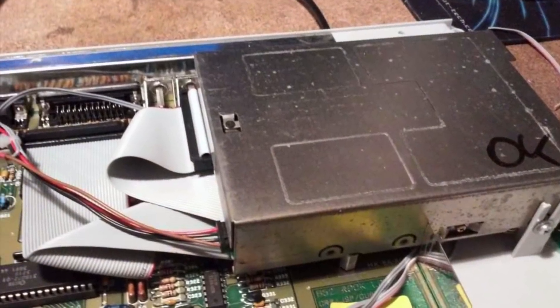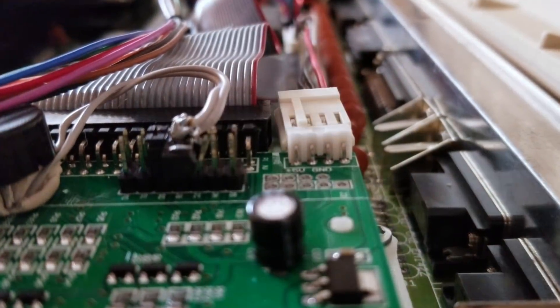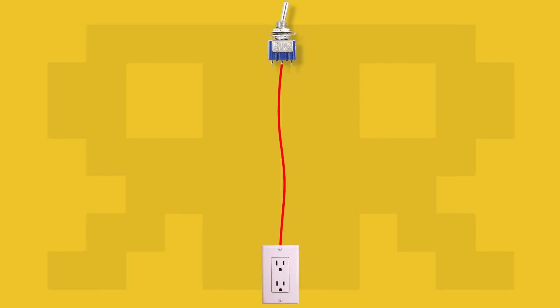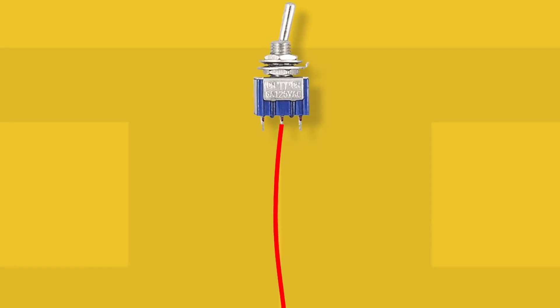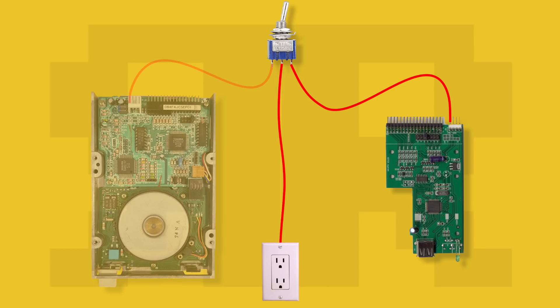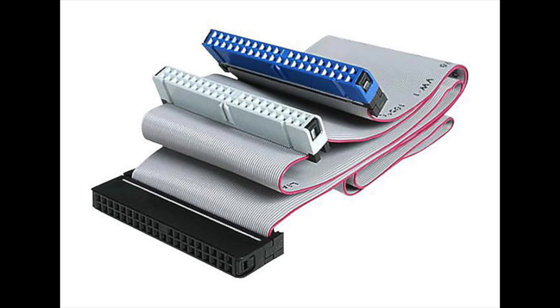But the whole point of this is we want to be able to use a floppy drive and the Gotek drive — not at the same time, but just to be able to switch between them. This is the five volt power in of the Gotek drive. So let's illustrate this: let's assume we've got our five volts power, and we're going to attach it not to the drive but to this switch. This is known as an SPDT switch, and that means single pole dual throw — literally it has one wire coming in and dual wires coming out. Then we're going to run a wire from the switch to the five volt line of the floppy drive, and a second one to the Gotek drive. And then by flicking this switch, it diverts that five volts either to the floppy or to the Gotek, and that way the other device becomes invisible to the Amiga. And then you just daisy-chain the drives with a double ribbon connector.